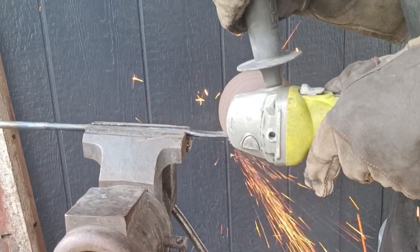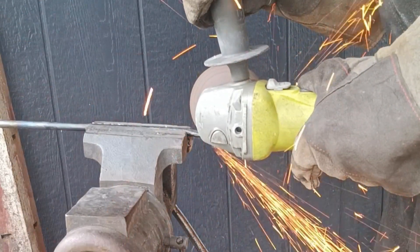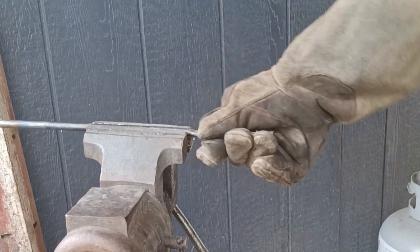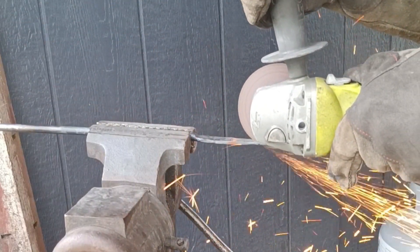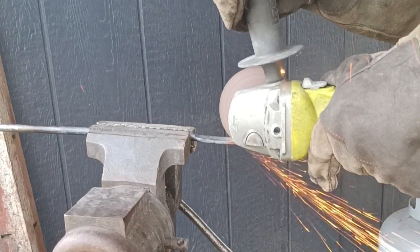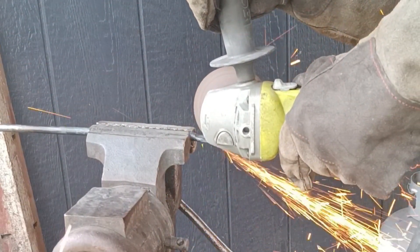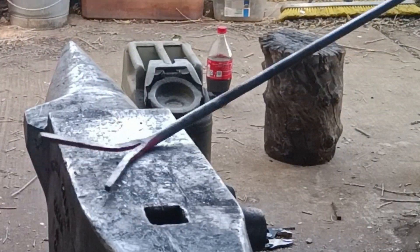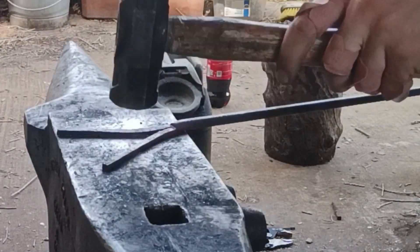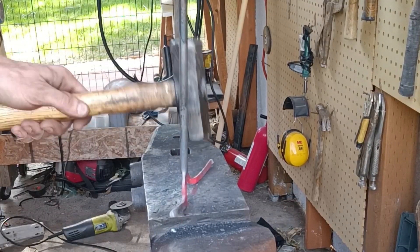While cutting, I make sure to stop just short of the shoulders I created before they draw down into that taper, just to make sure there's enough mass in that section when I spread these so they're not going to be fragile and they're not going to develop cracks. Now that I've got them all split I can begin to spread these guys out so I can draw them into a thinner profile and get some nice points put on them.